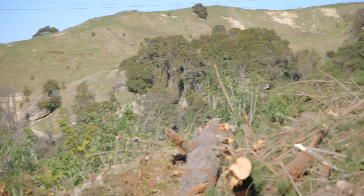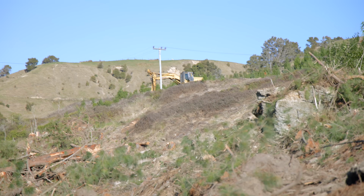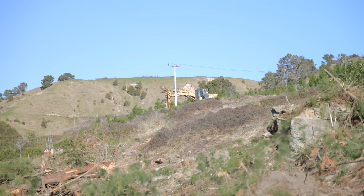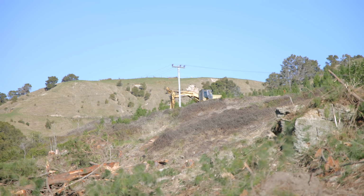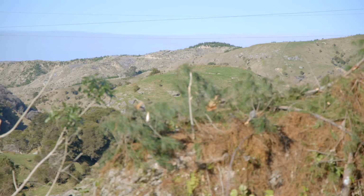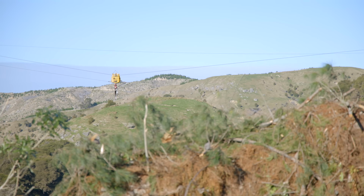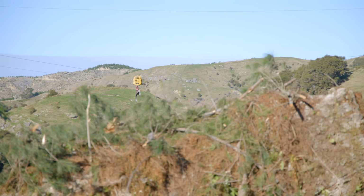It looks to be working really well. That main rope is just straight onto the front of the carriage, and the tail rope's going around a block to the side, then out to the tail hold, then back to the back side of the carriage, and it's just humming.